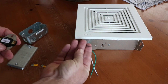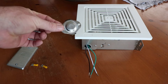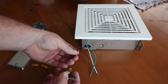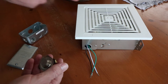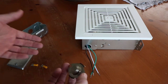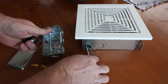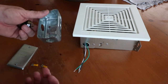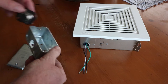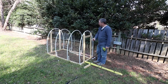The black hot wire on this fan will get wired to one side of this thermal switch, and the hot wire from the supply will get wired to the other side. When the greenhouse hits 100 degrees, the switch comes on and completes the circuit. When it goes down to 80 degrees, it turns off. So anytime this greenhouse hits 100 degrees, the fan will turn on and exhaust air until it drops back down to 80 — which on summer afternoons it probably won't, it'll just run a lot. In the evening it'll hit 80 and turn off. I'm going to mount the switch inside this electric box and bring the fan wires in from the bottom.